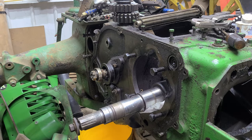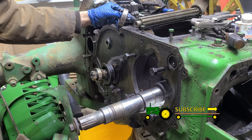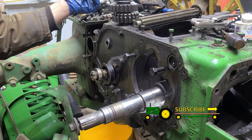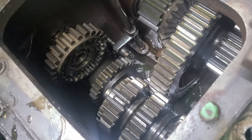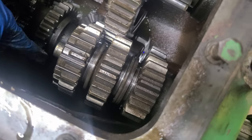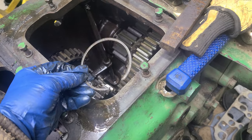Just know the importance depending on what tractor you're working on — they did change that. I'm going to wait to put on the lock wire to make sure everything's back together. This bearing goes on the end of this shaft and is driven into that gear. I wish I would have put it in first, but it turns out I could just insert that bearing in there pretty lightly. Got the shaft started with the gears on — make sure you get them in the correct order — and we're going to slide this in and start driving it until we can get that snap ring back in.